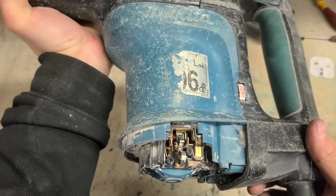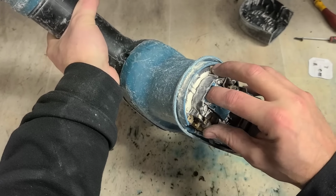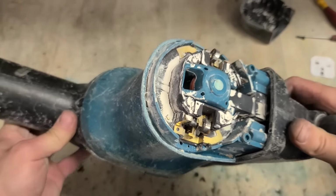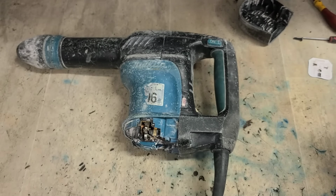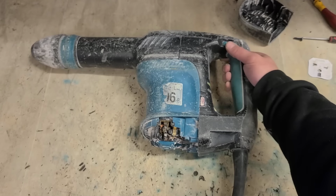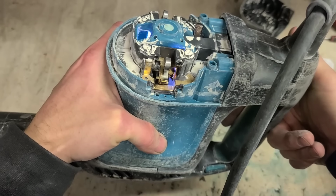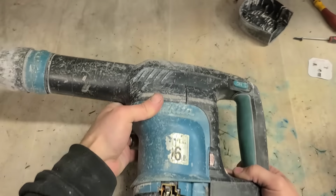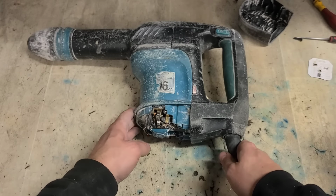The leads aren't actually burnt. She is getting warm. So unless that's burnt out, burnt up a set of brushes, and it's just after fitting in a new set to see if it cured it, I would say that motor's gone. Right, that's a motor. Armature's gone on that.